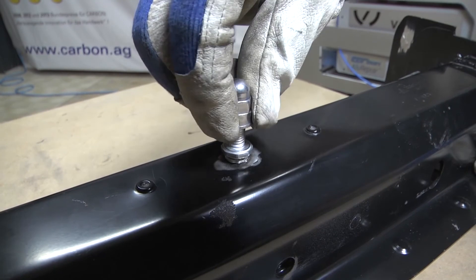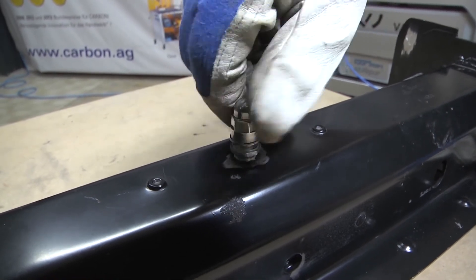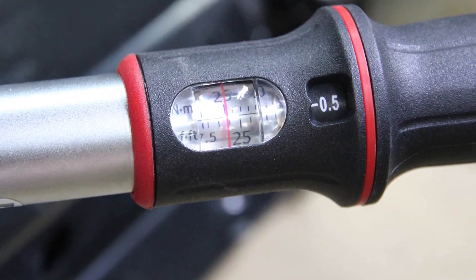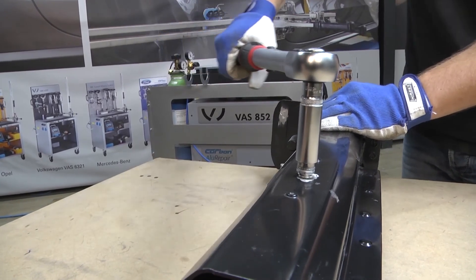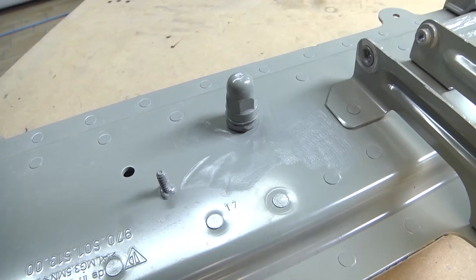So that you can see the weld has the correct strength, we will screw a cap nut onto the bolt and, using a torque wrench set to 25 Nm, observe at what point the bolt breaks away from the component when torque is applied. You can see that when the torque wrench is turned, the bolt becomes softer above 25 Nm and shears off close to 30 Nm. 8mm bolts like this one are tightened on average at a maximum of 20 Nm when conducting repairs.